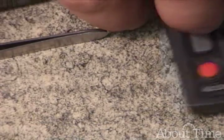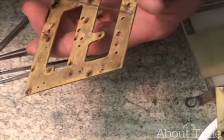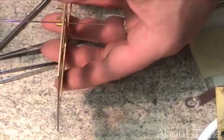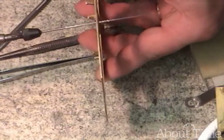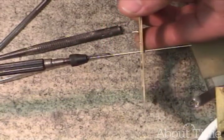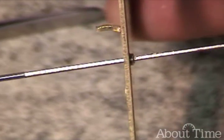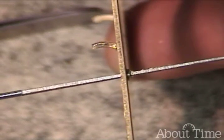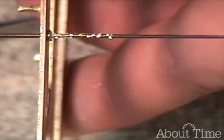Now it's time to size the hole. This is why I said it wasn't absolutely necessary that you get your bushing absolutely square in the plate. So if it was canted one way or the other — let's say that when I first put my bushing in I got it a little off, it happens occasionally — now it's time to ream it and I see, oh my, look at how that reamer is going off in the wrong direction. Simply ream your hole true.